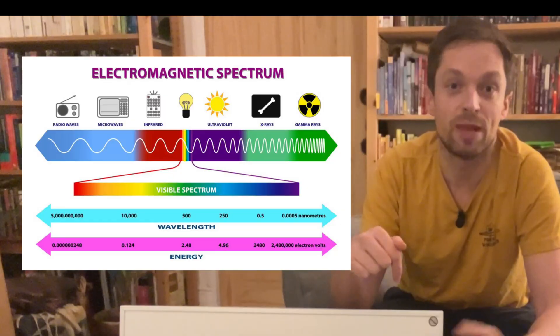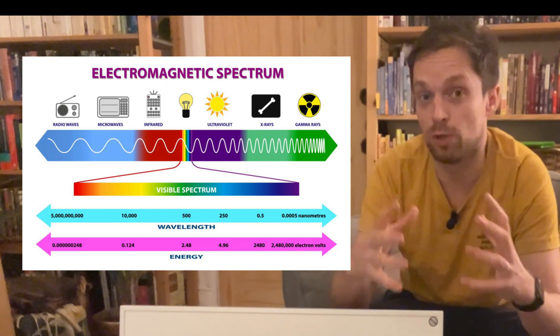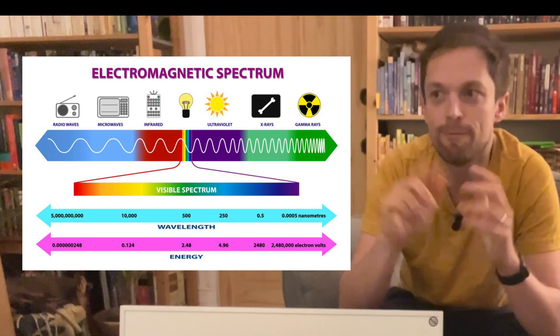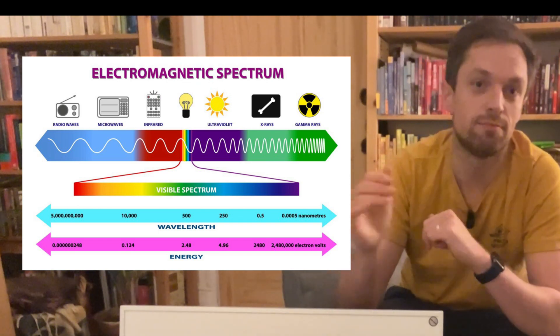Infrared radiators provide warmth by directing infrared radiation at an object, and this is what we call radiative heat. It's similar to when on a cold winter's day, you still feel warm in sunlight. Infrared heat is compared with traditional radiators, either in a central heating system or plug-in radiators that, despite the name radiator, actually provide heat through convection — whether it's heat in the air or through conduction, if you're sat touching or leaning against a radiator.